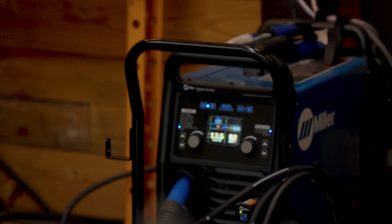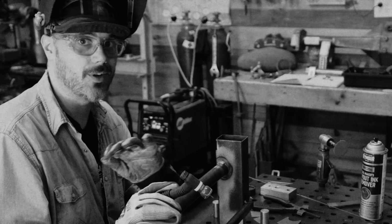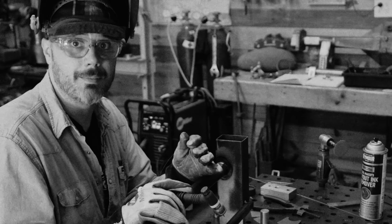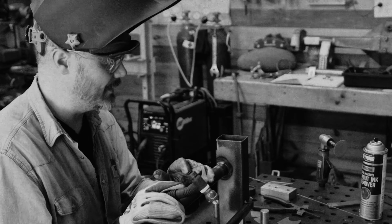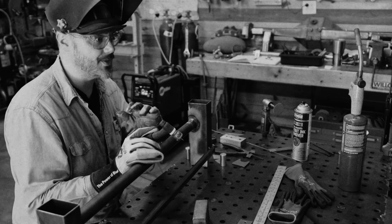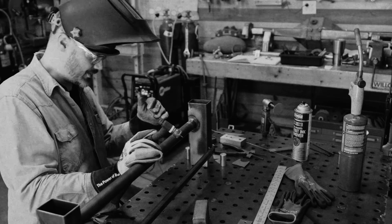If you want to make the welds that are really super pretty, like on trophy trucks, that's a 2-pass operation with the root being constant current, very important, so that you get good penetration. And then the top being some sort of usually pulsed cap. You're either pulsing with a pedal or, if your machine has a pulsing feature, you're using that. I like both, but the pulsing feature on the machine is extremely consistent, and the machine has it, so I like to use it. That's what we're gonna do.